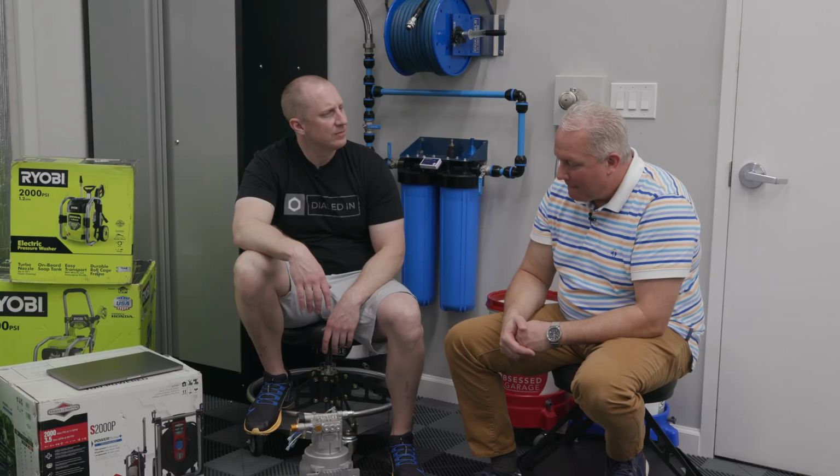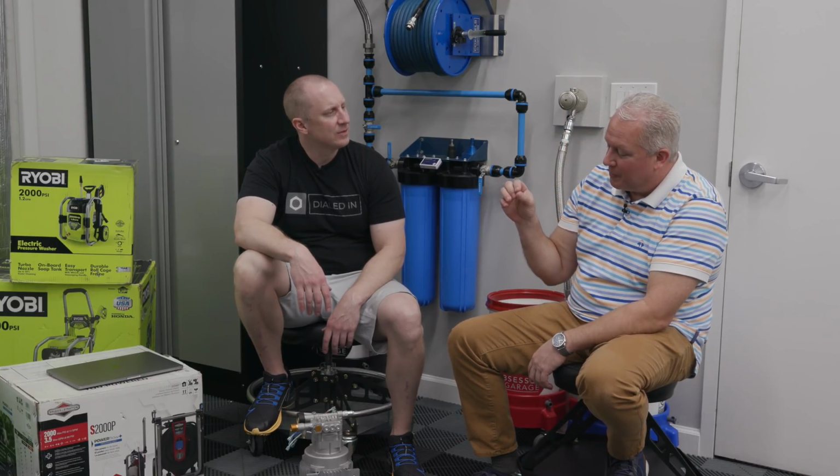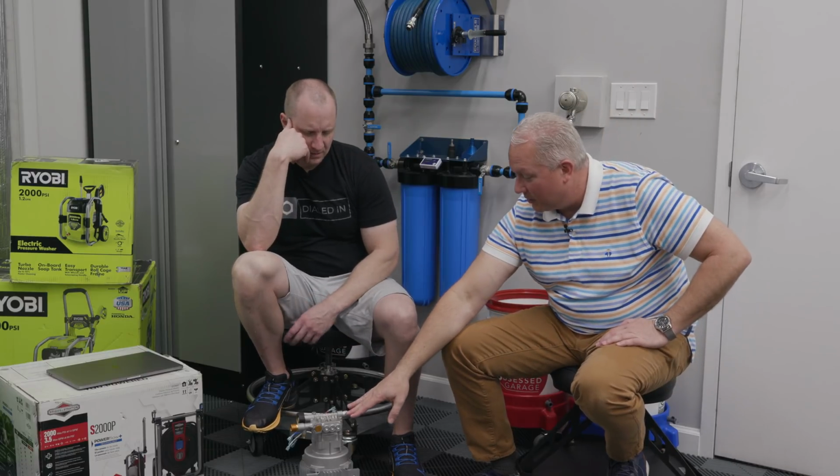So I think just looking at it, if you took 5 or 6 of the same branded pressure washer and took the pump and motor out and looked at it, it basically may look the same, until you get from a brush to an induction motor. But there's a couple things to be said there. The pump itself, we talked about a little bit earlier, you have that wobble plate, which you can think about as like the crankshaft in your car.